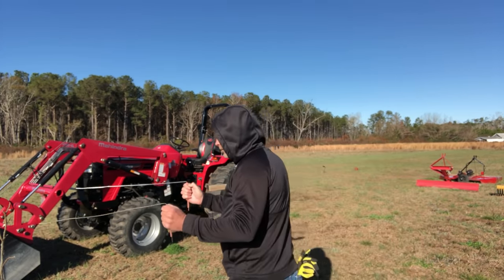Okay, we're down now about 8 or 9 feet. So it's time to put that second section on. This first 8 or 9 feet has taken me about 20 minutes of cutting. It is very wet. We've had a lot of rain over the last few weeks and the ground is saturated. I know I'm not in the water table yet, even though the hole's filling with water, because I haven't hit the water sands.